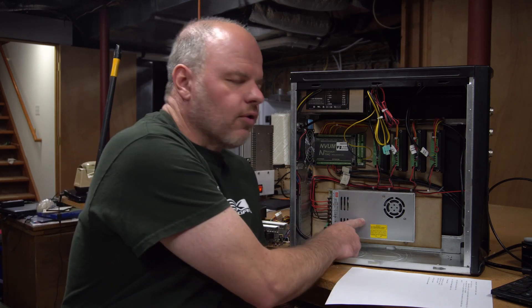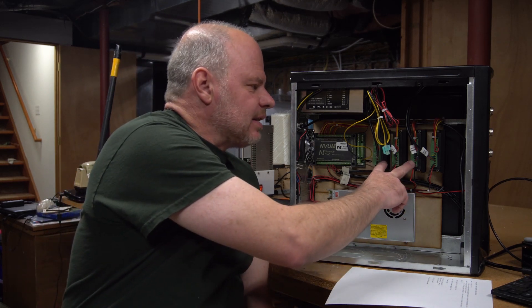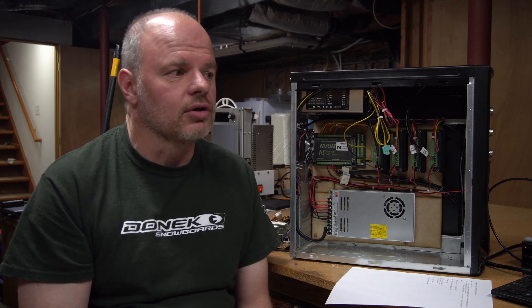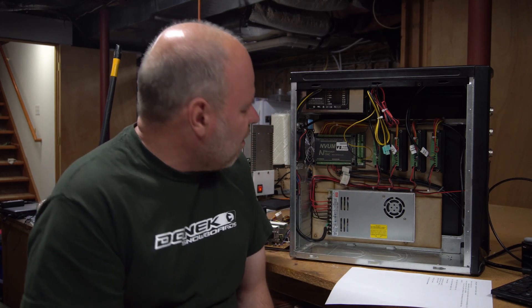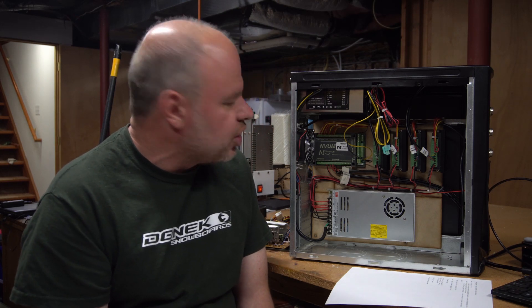This kit comes stock with a 24 volt power supply. But these TB6600s can handle 40 volts, so you could run those on a 36 volt power supply and maybe even pump it up a little bit — there are pots in there for adjusting that — and get as much as 40 volts to your stepper motors, which is going to give you at least one and a half times the torque on the motors. The problem, however, is that this NovaSun controller operates on, I think, 12 to 32 volts. So you have to provide it with a lower voltage than that 36 volt power supply if you intend to upgrade, which I probably will.